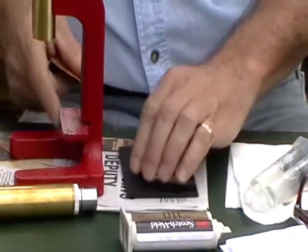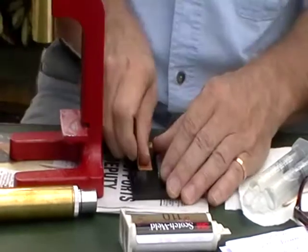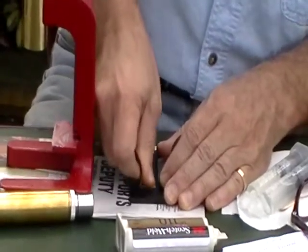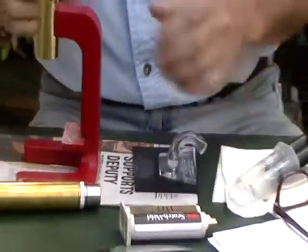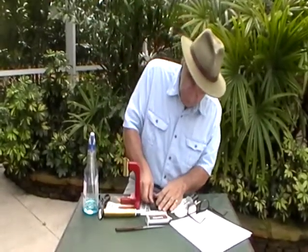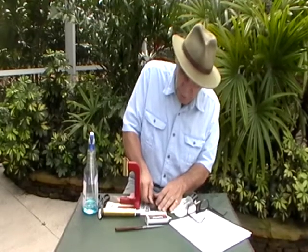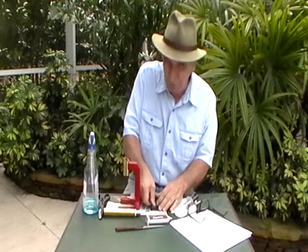Look at how much you have to cover — these are matching surfaces here, so you sand both, but you sand this one more. For all I know there's a slight oil film, but we tried different solvents and it still didn't want to take. We didn't realize that they sold us glue that was probably six months old, and then it sat on our shelves for a few more months. The life span of that glue is 15 months, but for all you know it doesn't work very well after 12.